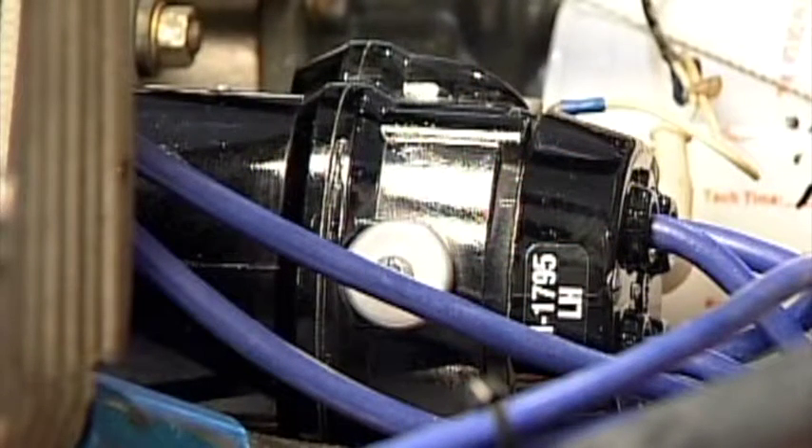Spark plug maintenance is one of the easiest and most effective ways to monitor the health of your cylinders. All spark plugs should be checked, cleaned, and adjusted on a regular basis. It's a good idea to maintain your plugs at each oil change. Not only will clean plugs help your engine perform better, but each plug tells a story about what's going on inside the cylinder. As with every inspection, it's a lot better to identify potential problems on the ground rather than in the air.